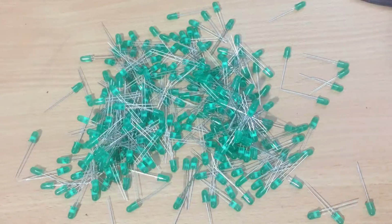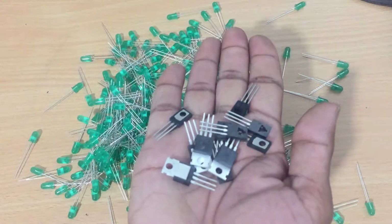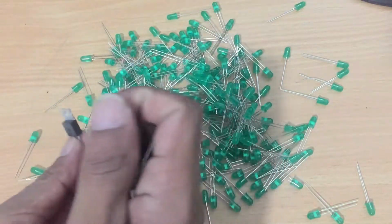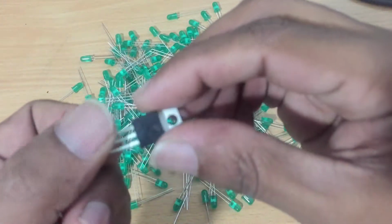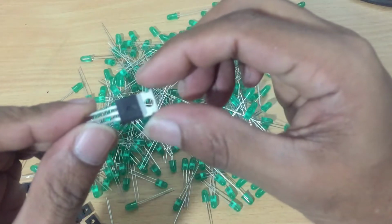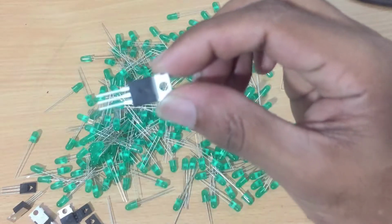As a solution, I decided to create another LED clock with a new RTC module. Since I want to add some additional features, I decided to build it without the seconds part. Therefore, this LED clock will show only hours and minutes. The special thing is that I am going to use the DS3231 RTC module, and it also includes a rotary encoder to change the hours and minutes.